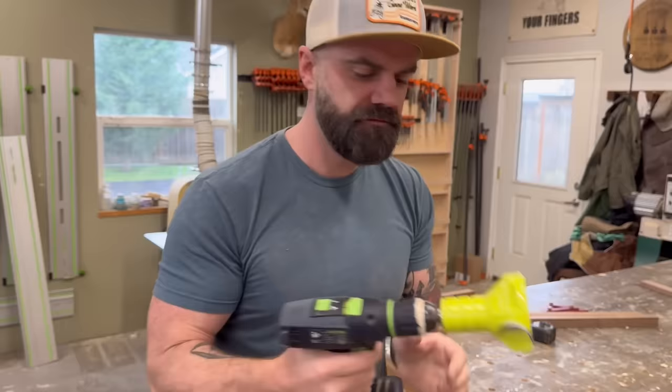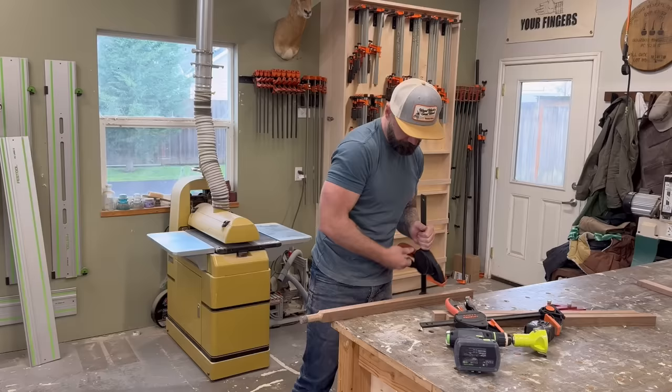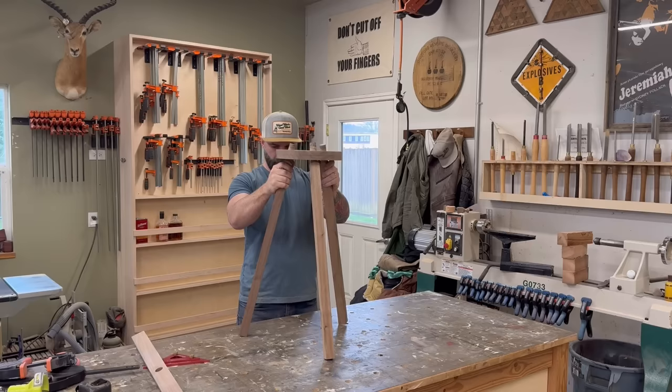The legs that need to come through the top are square and the holes I just drilled are round. Luckily I found this tool on Amazon — basically a pencil sharpener that fits in the end of your drill — which takes square stock and gives it a perfectly one-inch round tenon. You just chuck it up in your drill and use it like a giant pencil sharpener. It took a little bit to figure out, but at the end of my square stock I had a pretty good-looking one-inch round tenon that fit right through those holes. Pretty soon I made round tenons on all three legs and stuck them through the top of the stool seat — this thing is really starting to look like a stool.